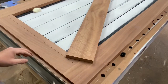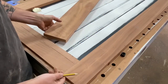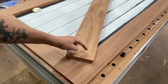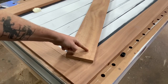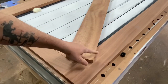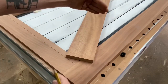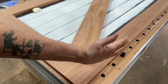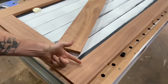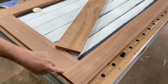I understand why they do it, but there's a rule, really, that you shouldn't do that. When you do that, you're transferring a lot of the weight, not so prominent on this door because of the angle I've got the brace at, back onto here. When it wants to compress down, it will shift this over, and if you're pushing that over, then at some point you're either pushing that out or moving this back into the frame. You're going to open this joint.